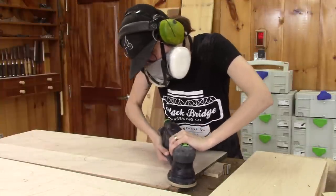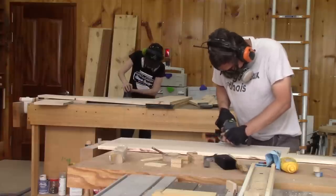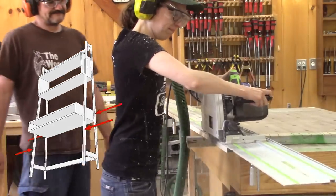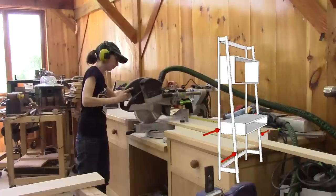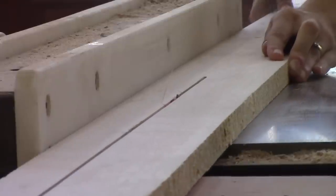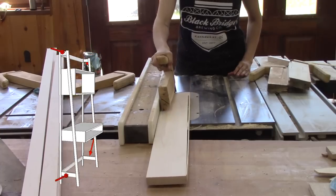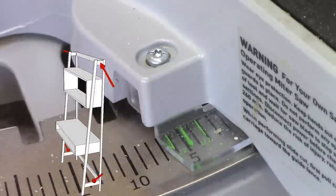When I'm finished, I also use an orbital sander. I spend the rest of the day sanding. At my next visit, I finally get to start the assembly. The first thing we do is the two lateral supports. I cut four pieces for the stiles. After, I have to take care of the rails. All the rails have a straight cut and a cut at a five degree angle.